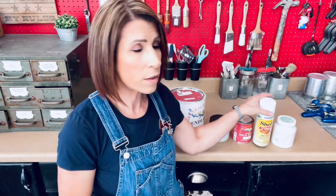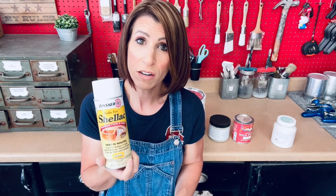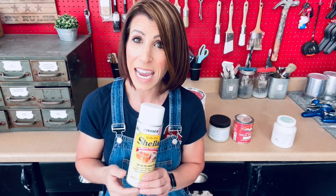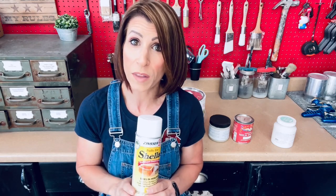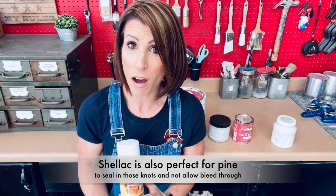Now let's talk about if you decide to topcoat your white — what can you do to make sure you put some extra added steps in there to help prevent yellowing? One of the things that I love and always have in my shop is shellac. In my opinion this is the do-all, catch-all, fantastic number-one sealing and blocking primer. I use this on cherry, mahogany, even some of the golden oaks. When you're painting white, even if you're not topcoating, it's a good idea to prime your piece. That will block any tannins that may bleed through and turn it yellow — so it's not just topcoating that can cause yellowing, it's the tannins in the wood bleeding through. Putting this underneath your project will help prevent any yellowing.